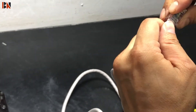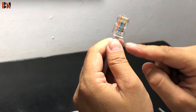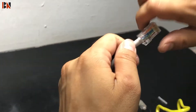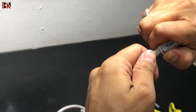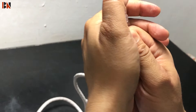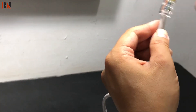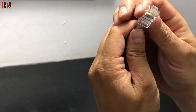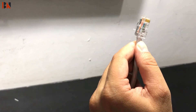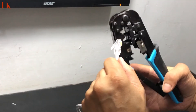So this is the process of color coding and you can see all the color codes. You can push this wire and push it - push and tighten the wires, put all the wires on the front, press and tighten the wire, put the lock on the back. Let's confirm: orange-white, orange, green-white, blue, blue-white, green, brown-white, brown. This is how you crimp the RJ45 jack - you press it and lock it.